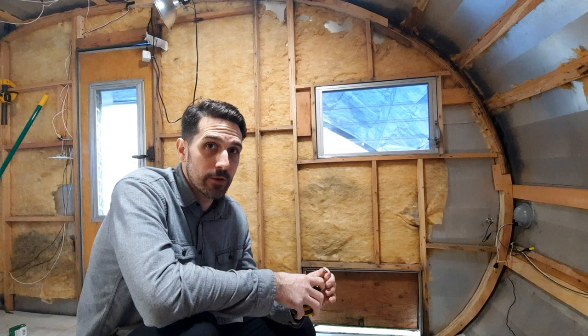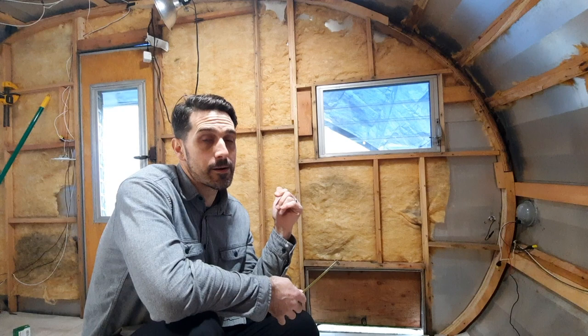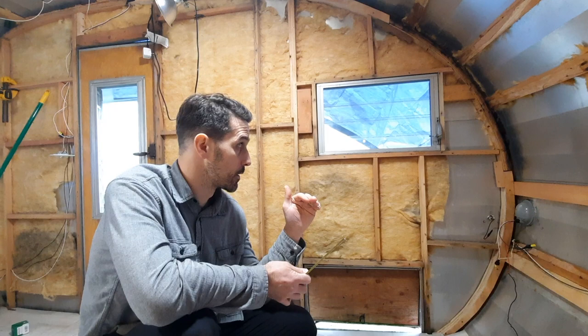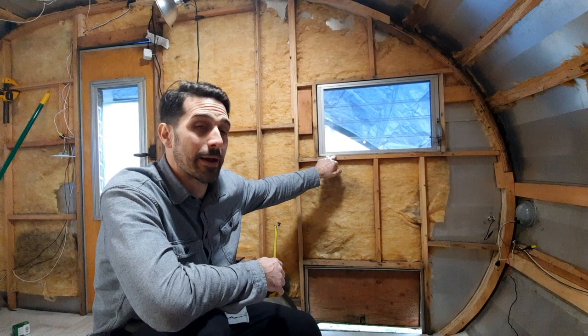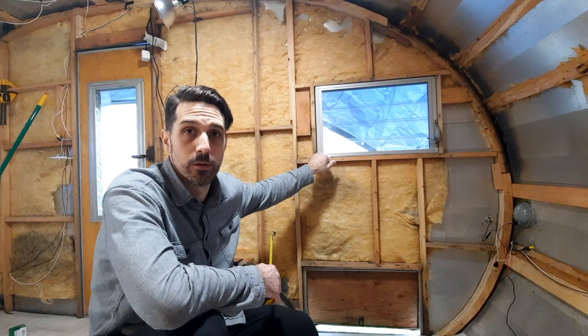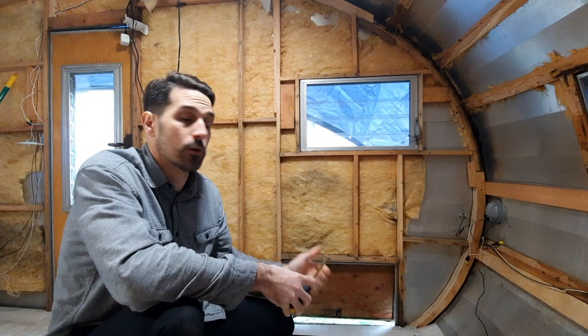Originally today I wanted to install the interior paneling and insulation, but with the interior walls still open, now is a good time to build your window frame. I'm going to mark where my service window is going to be cut out, cut it out, then figure out where to frame the window. Be mindful of your countertop height inside — you don't want it sitting above your window opening. Since this is 36 inches, I'm going to try to have my countertop right in line with the bottom of the window and possibly extend out the window a little bit as a shelf. Whatever window you put in, be mindful of the weight because these wall studs can only hold so much.